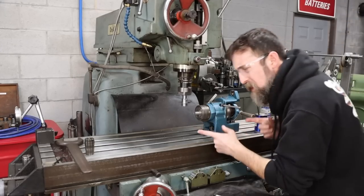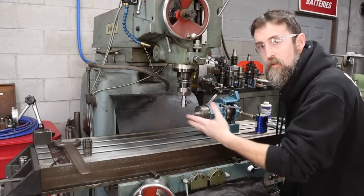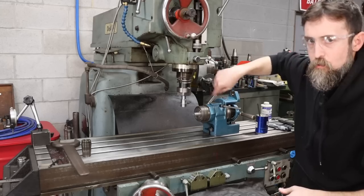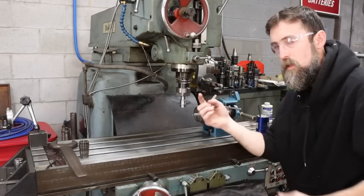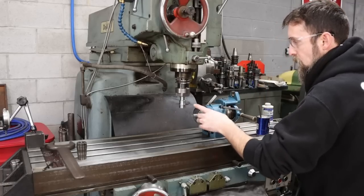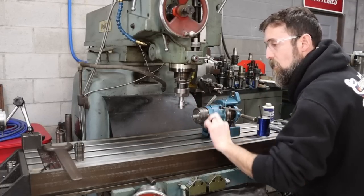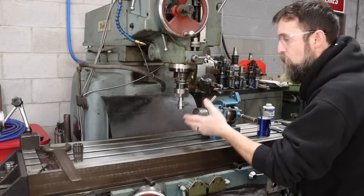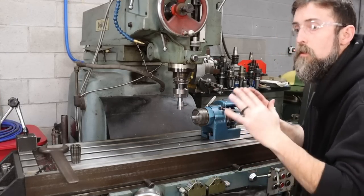So it is time for a test run on this slitting arbor. Now this arbor having a right-handed screw in it, it's pretty much a clockwise rotation setup. No key, so if it tries to slip, I want it to try to tighten the bolt instead of the alternative. So that's my main concern. Is it going to slip? 28 thousandths of an inch is about the thickest saw that I have in a 5/8 bore that I plan to use with this. So if it doesn't slip with this, it's not going to slip at all, or it shouldn't.